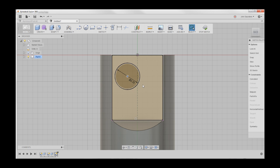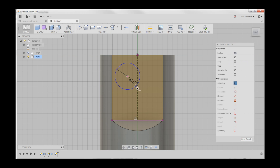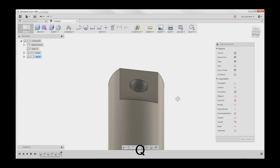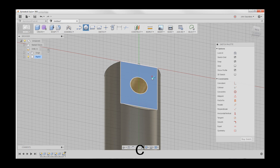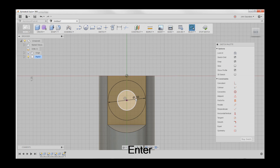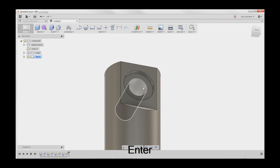I'm going to move this one off of it. Hit Point, put a point in the middle, and use a sketch constraint to make sure that stays right in the middle — it's black now. Q for press pull, drag all the way through. Hit C for circle, same thing right here, concentric 0.5 — actually it was 0.425 — and drag down 0.05. That's all we really need.